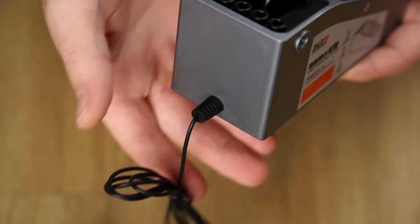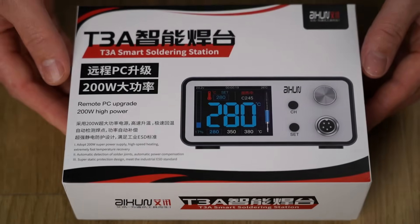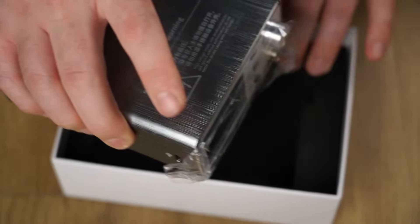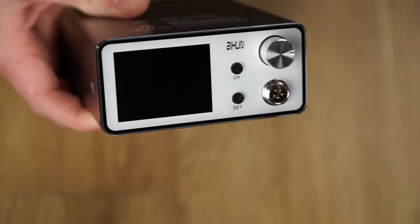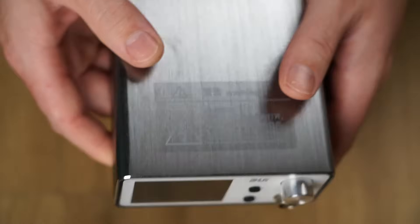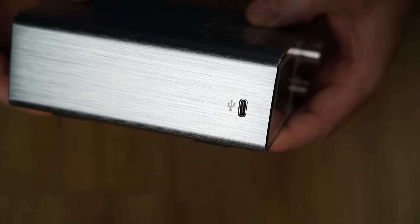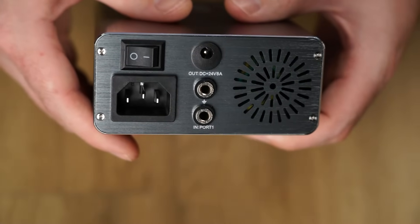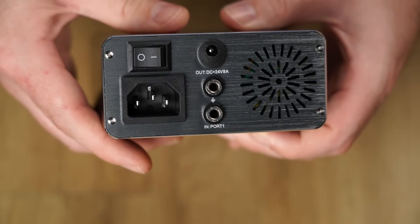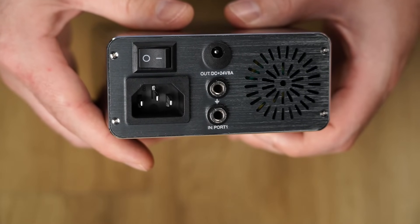At the back there is a cable used for the temperature setback feature. Moving on to unboxing the station — the body is constructed from brushed alloy. At the front we have a decently sized colour LCD screen, rotary encoder, menu buttons, and a port for the handpiece. On the side there is a USB type-C port for firmware upgrades, and at the back we have a power input socket, power switch, port 1 for the tool holder, a spare earth port, and lastly a 24 volt DC power output which can be used to run accessories such as an extractor fan.